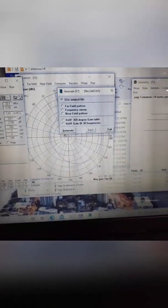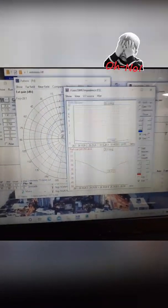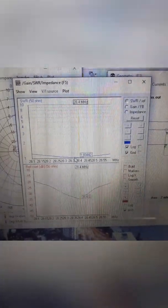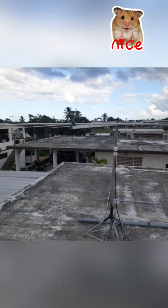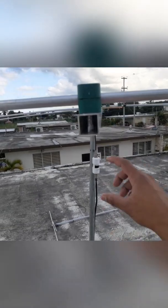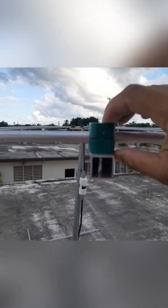Let's check the SWR. This is the three-element Yagi for 10 meters — only for 10 meters. This boom doesn't have a gamma match, so it's cut to 50 ohms. You just put the negative and positive in, use a ferrite choke, and that antenna is tuned for that band. See the insulator here from the boom.